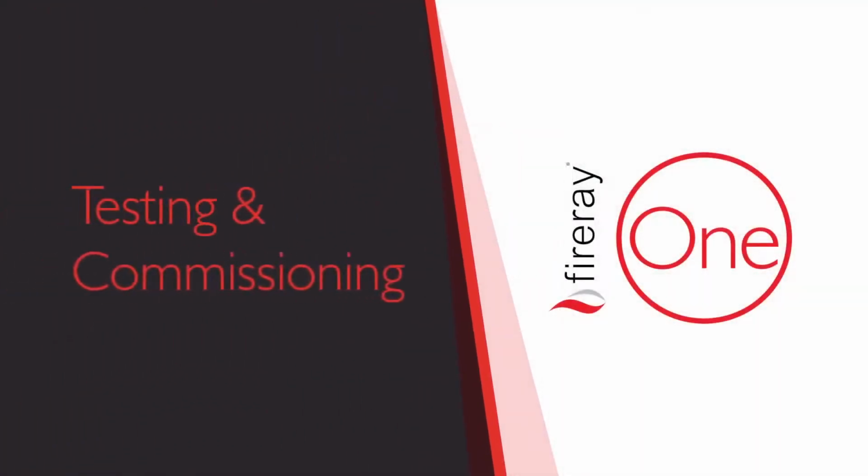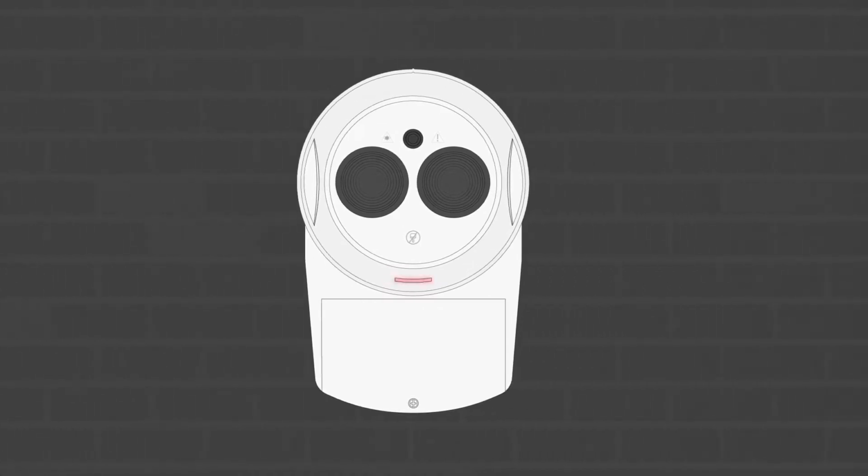To check that the Fireray One operates and alarms in a fault and fire condition, we need to carry out a couple of simple tests, which are to simulate a fire condition over 3/4 of the reflector with a non-reflective material and wait for the indicator light on the bottom of the unit to flash red. To simulate a fault condition, cover over the full reflector and wait for the indicator light on the bottom of the unit to flash amber.